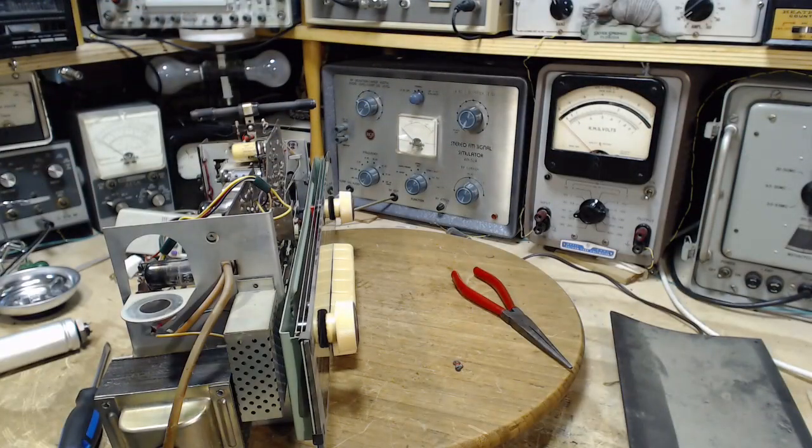So the wires, is that what this yellow wire is? This yellow wire, and the yellow and the green wire going into the can, is that what they're doing? They're going to the resistor? They probably are. Because you see up here, the yellow and the green wires. The resistor is positioned between the two capacitors, and sure enough, that's where these yellow and green wires are going. So definitely, I just measured between these two wires. We'll get that power supply resistor. It's definitely worth checking before going further.